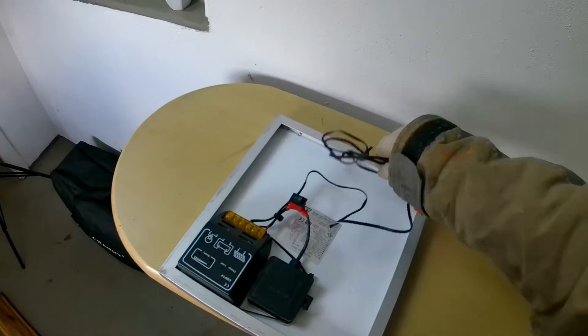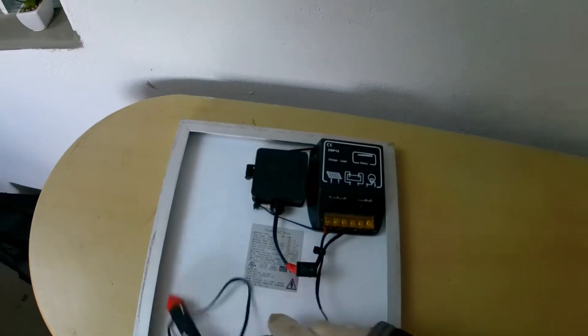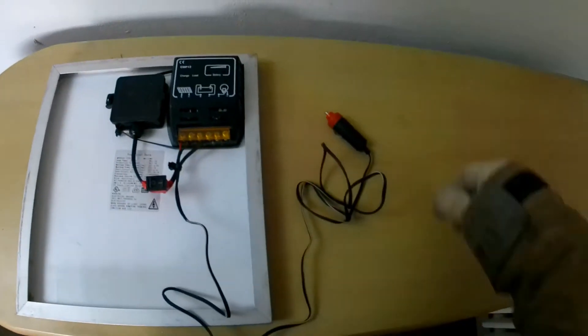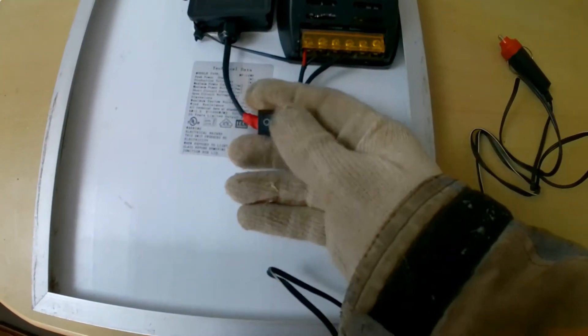All the parts for this were sourced from my used electronics box. We have a simple plug to connect the system to the cigarette lighter port, although this does not work on all vehicle types — more on that later. I used a small 5 ampere charge controller, a simple on/off switch, and some shrink tube to protect the wires, and connected it all together.